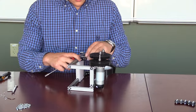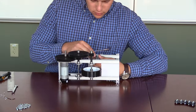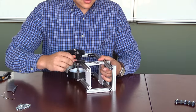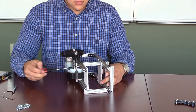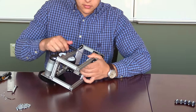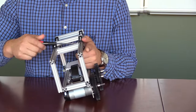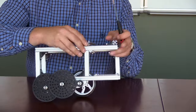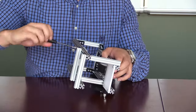At this point, we will take one of the small game pieces and stick it between the piece of plastic and the last piece of metal extrusion that we recently added. We want this ball to be able to slide in pretty easily. We will make sure that the plastic lines up as well as the extrusion — this may involve shifting the center post that mounts the bottom piece of plastic. At this point, we can tighten everything down, including the vertical post that we used to allow to move freely. When you are done with this step, there shouldn't be anything that is allowed to freely move.